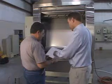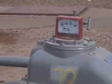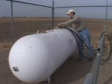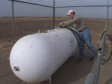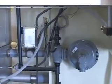If there are questions about the suitability of the water supply, the factory will be happy to assist with a laboratory analysis and recommendations for treatment. The unit will also need combustion fuel. You may burn either natural gas or propane with equal effectiveness. If propane is used, ensure your vaporizer is sized to handle the additional load of approximately 1.5 million BTU per hour. The gas supply is connected to the unit here.